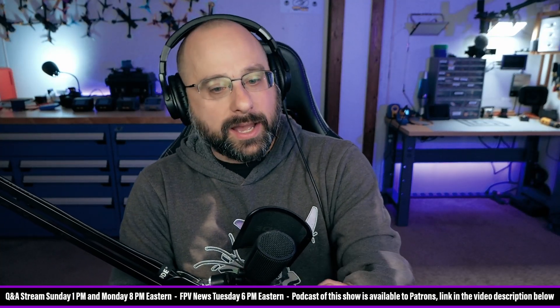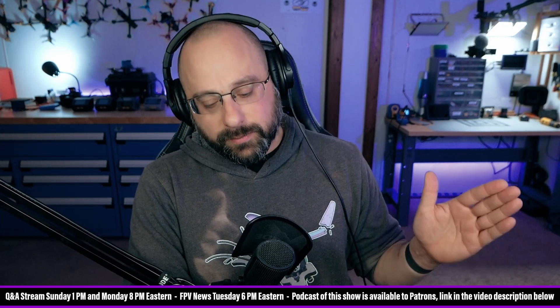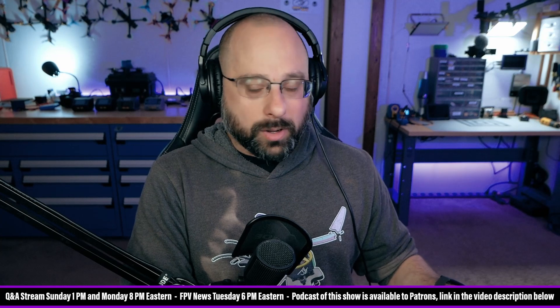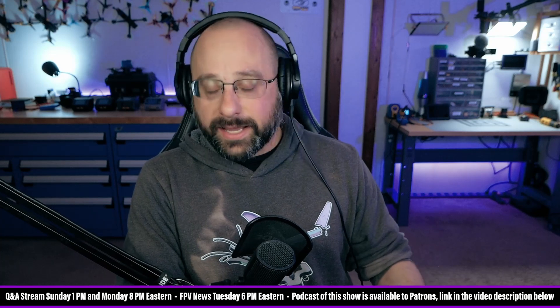Justin Rice, thanks for the five dollar super chat. 'Any guides on DIY 8S batteries instead of using two 4S batteries?' Justin, my question to you would be: why is the process of building your own pack by spot welding tabs on cells and yada yada yada more appealing than just building a series adapter for two 4S batteries? Everybody I know who runs 8S or 12S quadcopters just has two batteries in series with a series adapter. It makes charging simpler — you'd need an 8S charger, they do exist, but why not just use 4S batteries?